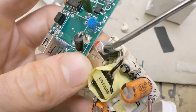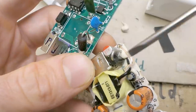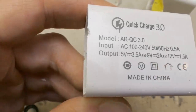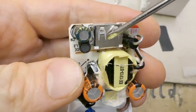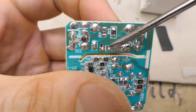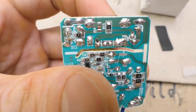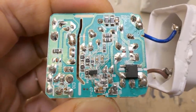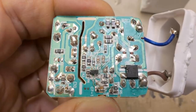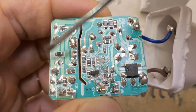Note that this output diode is the same size as the diode in one of the cheap chargers, but this is a 1 amp charger while the other one claims 3.5 amps. Here is the USB port — being just a 1 amp charger, it has the data pins connected with each other, indicating its current capability. And it has no optocoupler; the voltage is sensed using the auxiliary winding, designed such that the output voltage is accurate enough without secondary-side voltage sensing.